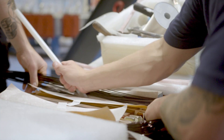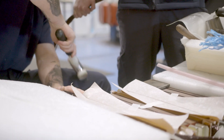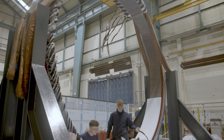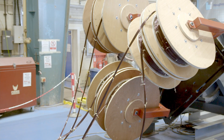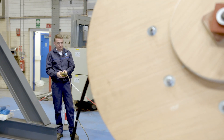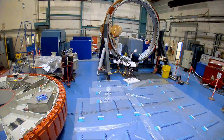This Enercon generator stator has over 50 miles of copper and there are a lot of conductors in parallel. We've had to order the copper in and split it into continuous drums of over 300 kilos per drum, and then wind the stator continuously with no breaks. We've had to develop a system to allow us to do that — using our own expertise in our R&D department and manufacturing, we've had to make our own jigs and our own manipulator to be able to achieve that.